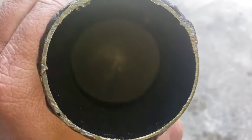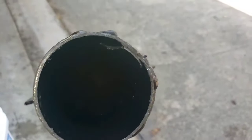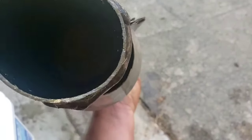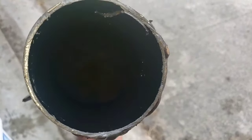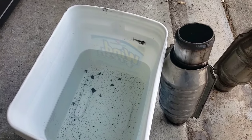Now let's look at the final product. I just realized I have a light on this thing — hopefully you can see that, but the inside looks really clean. So these are ready to be reinstalled if you were going to do that, but these are probably just going to end up on the shelves or get recycled. I don't have any use for them. But here's what came out of that — probably another two gallons. Now, there's also one thing you need to consider: if your catalytic converter is cracked, or you see a crack in it, or chunks come out, there's no point in cleaning it. You're going to need a new one.